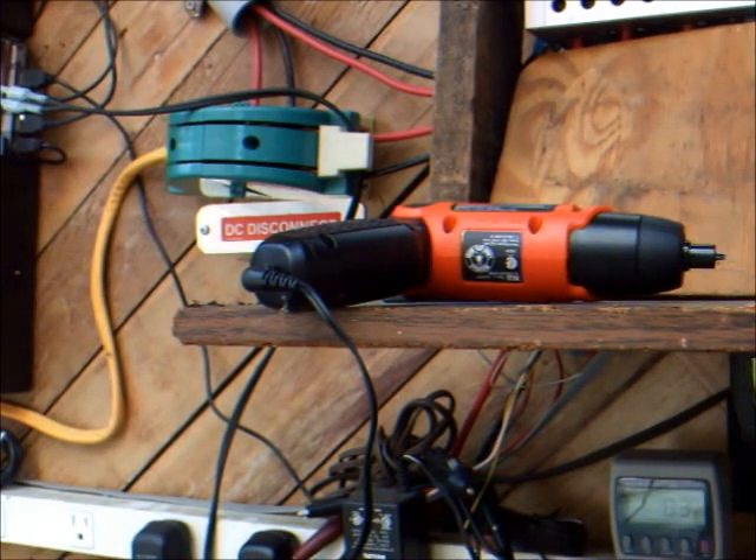One downside I noticed is that this charger requires about 18 hours of AC power to charge the battery. That works out to 54 watt-hours of AC energy, and with the inverter efficiency that's perhaps 65 watt-hours of DC energy. This screwdriver likely uses an 18650 type lithium cell, so probably has a 10 watt-hour capacity, meaning that off AC I'm only getting 15% efficiency in charging. With this lithium battery, the charging electronics is built into the driver itself and the plug-in wall wart is just a simple 9-volt Class 2 power supply. So I could use a small DC buck converter off my 12-volt battery bank to produce 9 volts to charge this driver off DC power directly.